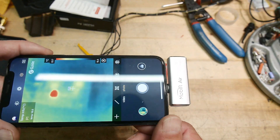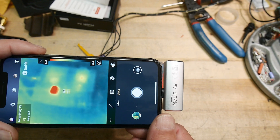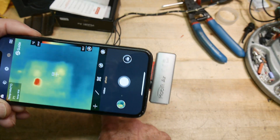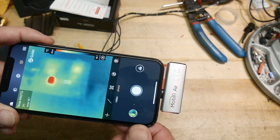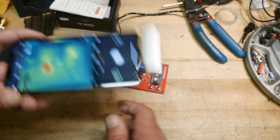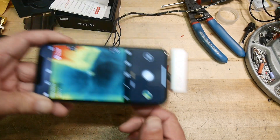It's a nice high-resolution thermal camera — 120 by 90. You can see all the individual things on a circuit board, so it's great for troubleshooting. If you have a problem, the thing that gets hot is the thing that's going bad, or drawing the most power. In this particular case, that one-gigahertz chip there is hot because it has analog circuitry in it.